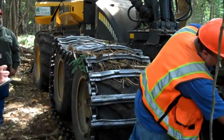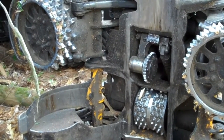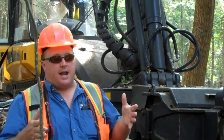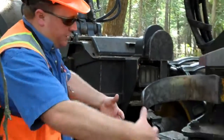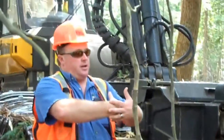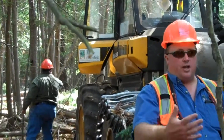The operator has to sharpen his chain and he breaks chains. That's the measuring wheel right there. When he goes to grab a tree, he presses a button that says it's pine, hardwood, cedar, spruce — whatever species it is. So when the machine grabs that tree, it knows what it's cutting. Say it's a pine — it looks for the highest value product it can cut, which is a pine saw log by diameter. When it closes its arms it measures the diameter, and that wheel measures the length. So it says, by diameter, this is big enough to be a saw log. Then it's up to the operator to confirm, because the machine can't see if it's crooked or rotten.